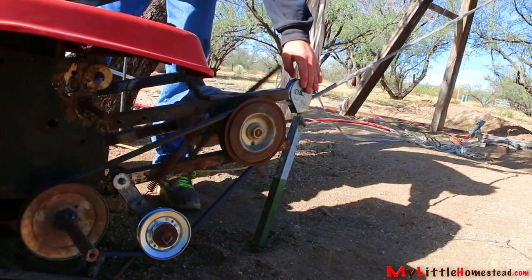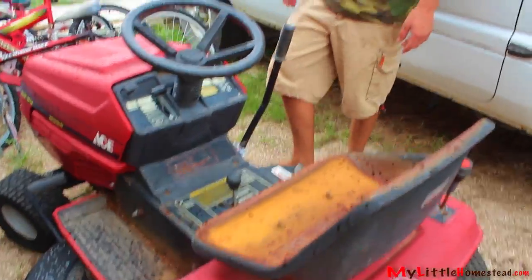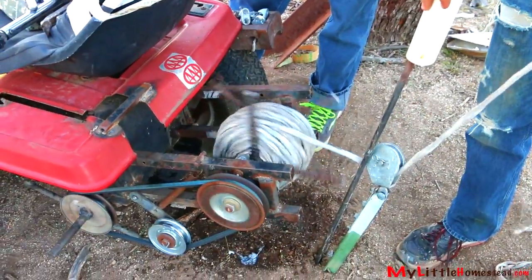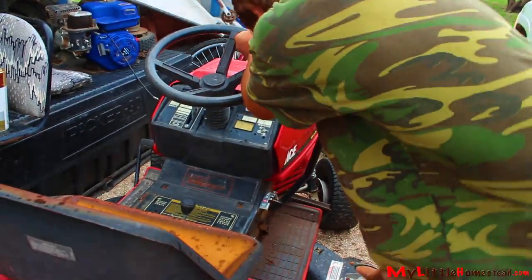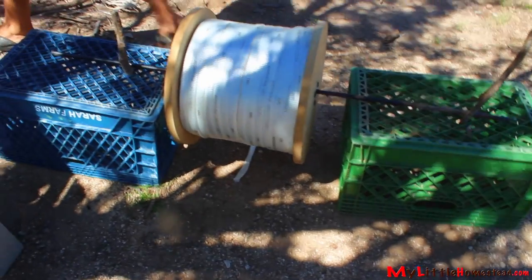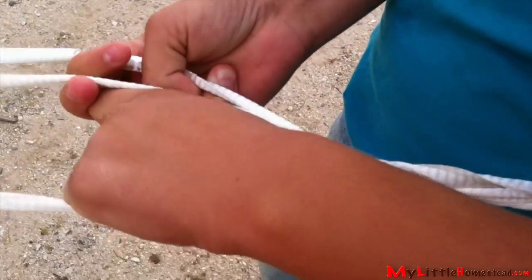To handle the cable with a different system, I welded and wired and hooked up a motorized system to the back of a lawnmower tractor. The plan is to use the belt from the mower engine, extend it out, and weld a frame to hold a spool with a pulley that goes up into the well. When you engage the blades it pulls the pipe up; when you disengage, it loosens the belt so it freely rolls and drops safely. We cut off about 200 feet of material for a rope — it took about three days for me and Bri to braid the entire thing.